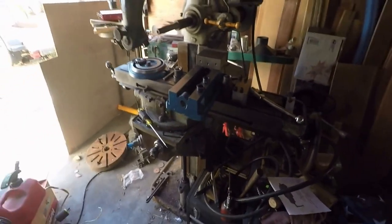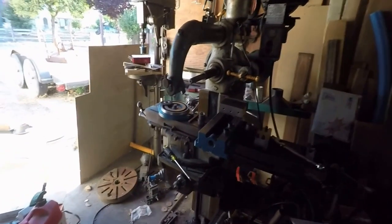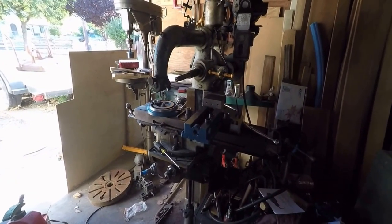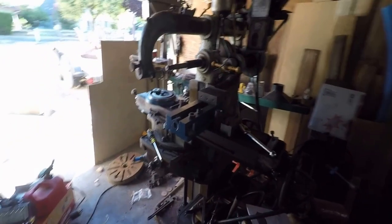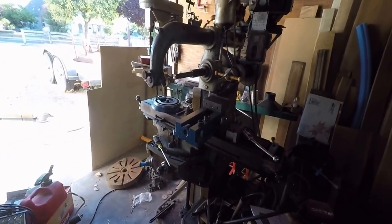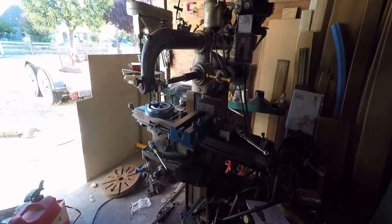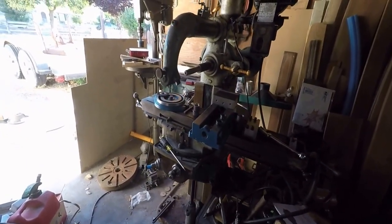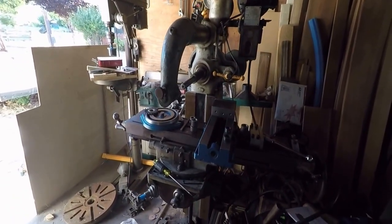I need to take that shaft out and clean up everything really good in there too. Haven't really gotten into that yet. Once I got the hand wheels done, I could operate the mill manually. That's the power feed drive, right? That's what drives the table. I would rather not put it under power with a broken mounting point on it. Probably it wouldn't hurt nothing, but who knows? They may have been running it that way anyhow. Anyway, after that, we're ready to go.